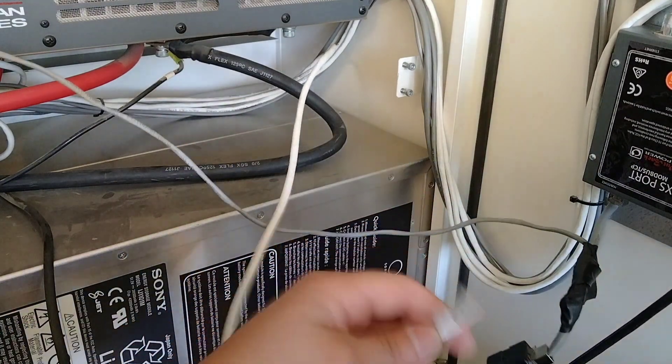Now there are a few other things to check. It's showing us here that the charge controller is off, so we're going to want to turn that on. We're also getting this flashing AC input — we're going to want to look at things in there. It says AC mode drop, so we're going to want to hit Use. Then we can go to Charger and check the charger mode. Since that's off, we want to turn that on and back out of there. We can start a bulk charge — hit Bulk Charge and Start Bulk.